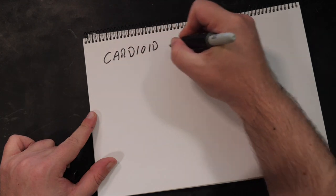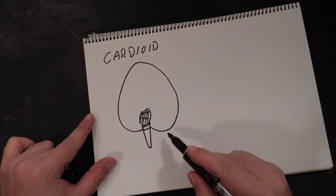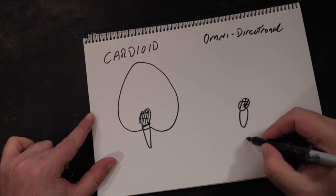The other thing worth mentioning about this microphone is the pickup pattern. It is cardioid as opposed to omnidirectional. Cardioid means it's a heart-shaped pickup pattern; omnidirectional means it picks up from all the way around. That means this has a good amount of rejection of noise off to the sides and the back. There's a car driving past right now — I don't know whether you even heard that. I can demonstrate: if I just pull this thing kind of off-axis, you can hear it very dramatically changes how I sound, and in an outdoor environment that's even more dramatic.